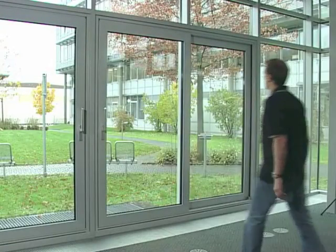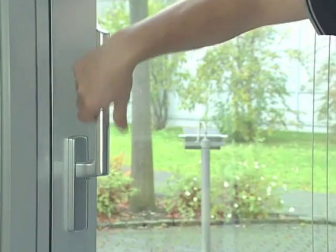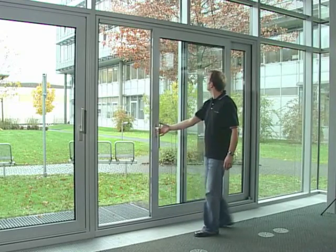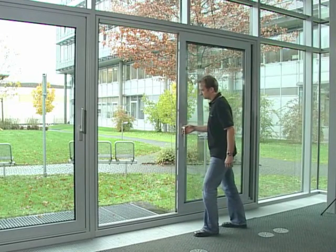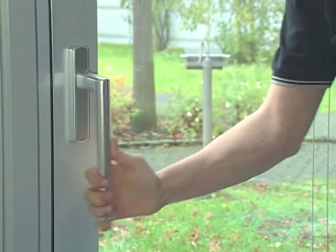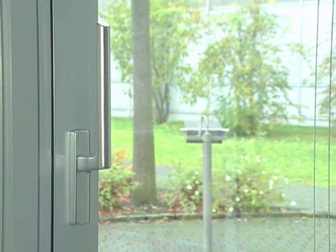Before assembly, the sash and the hardware should be checked to ensure free movement. Before assembly of the MHS400, the hardware must be easy to operate manually. Before installing the MHS400, ensure that the lift and slide element is not distorted and is fitted vertically into the soffit.